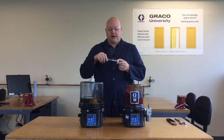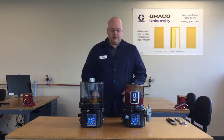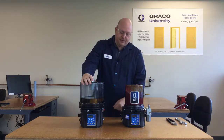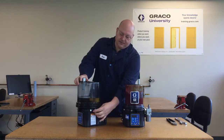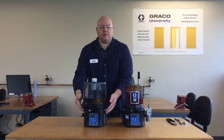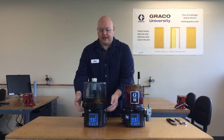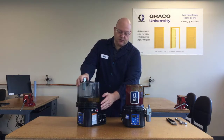The G-Series pumps have a motor inside with a cam that turns around and causes this piston pump to stroke back and forth. It's easy to see the pump here because this pump doesn't have any accessories attached, but the pump could be installed on the front or on the side — there are three positions. That's where the three in G3 comes from: you can have up to three pump elements.